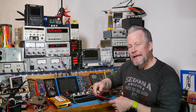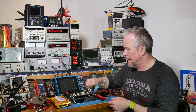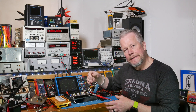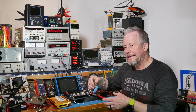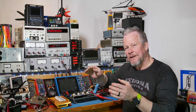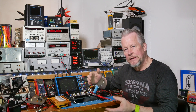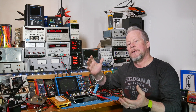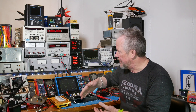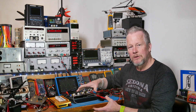What I did is I dialed back the bias current as far as I could drop it until I saw the distortion change, and I did that at different power levels. It didn't change a lot at different power levels, but once it starts to increase it pretty much does it across the board, across the frequencies I tried. So I'm just going to show you what it looks like at 1 kilohertz.